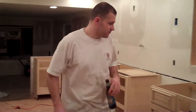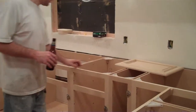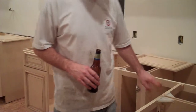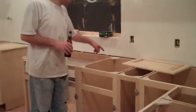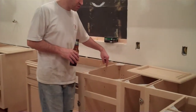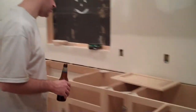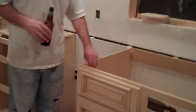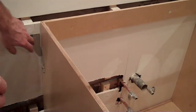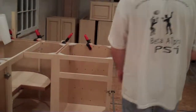Next weekend I'll clean everything up, tighten it up — nothing moving, it's solid. Screwed all the face frames together, and then put pocket hole screws. And then I took a half-inch ply and put it in between each one, because it's essentially a half-inch gap between the actual cabinets, and then screwed that together. So the cabinets are completely solid. And then on this side here, since it was an end cabinet, there was nothing really to tie it to because it's a sink base — the whole back's wide open. So I used hurricane straps, and it ain't moving. That should support the 1,500 pounds of granite.